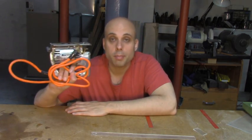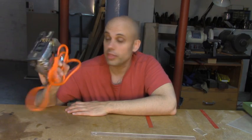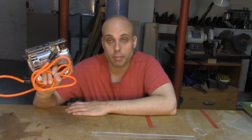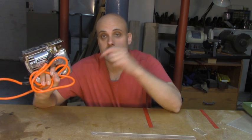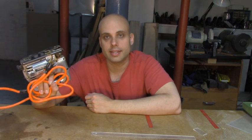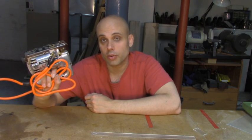For instance, my trusty old Black & Decker jigsaw — that's honestly a monster for woodwork — is terrible for acrylic. The blade has too much vibration, and it builds up too much heat because it's just going back and forth in a short path and there's nowhere for the heat to dissipate. So whenever I use this on acrylic, I just get a mess.